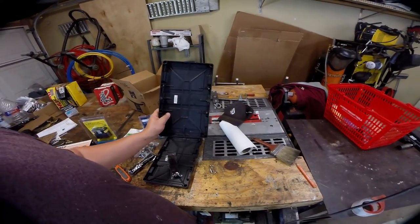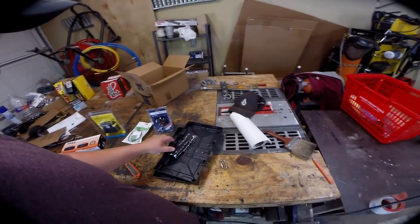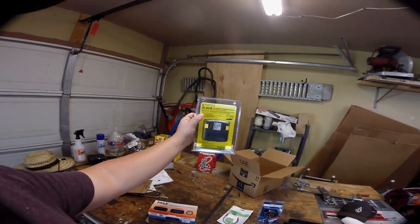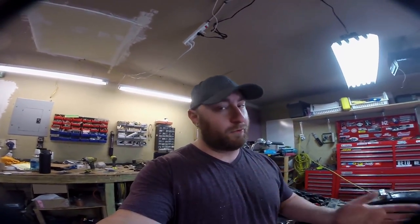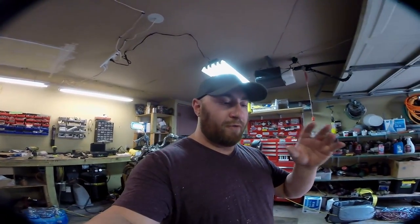The heart of that system is obviously the two batteries. This boat already has two batteries, but they are not secure. I'll link these below — they're about nine bucks, group 31 or group 24 trays, come with a strap, bolt down. I use the same thing in the adventure trailer. They work great and they're super cheap. But the heart of the system is this — this is the Blue Sea automatic charging relay. It's about 80 bucks. You can find isolation relays — solid state ones for around $60, or old-school solenoid ones for about $40. In my opinion the Blue Sea is the best on the market. It's water rated, fantastic. I have no relationship with them, not sponsored, paid full price.